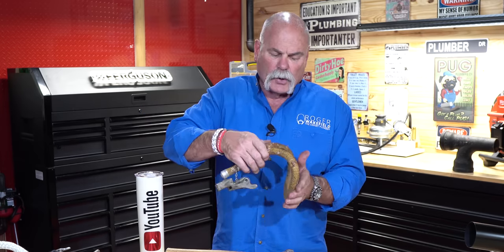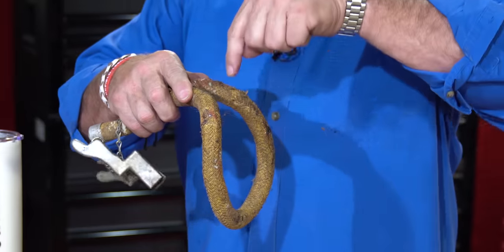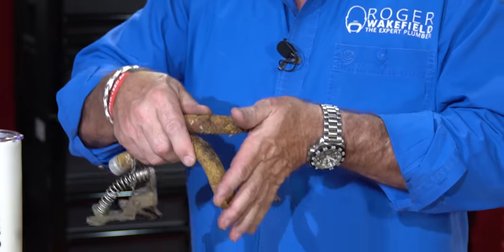If you're doing a vertical joint, you don't need it because you're going to pour the lead in — it's going to fill from the top and stop. But on a horizontal joint, you need something to hold the lead in because you're going to pour it in that triangle it'll make right there on the top. We'll show you that in a minute, even though we're not going to do it. But I'm going to go ahead and get some gloves on and we're going to start getting this thing ready to go.